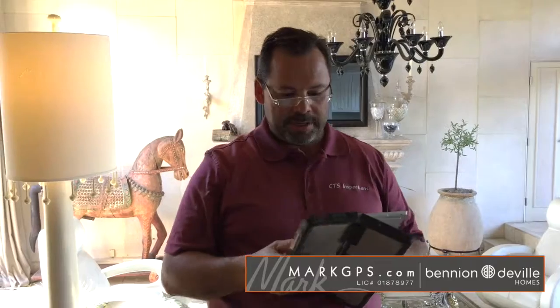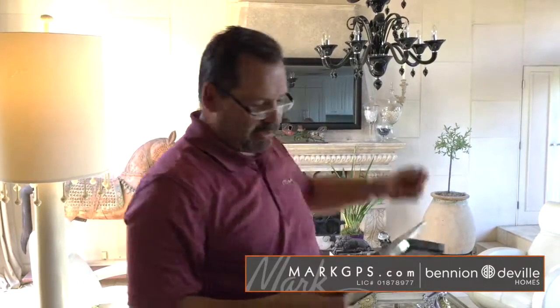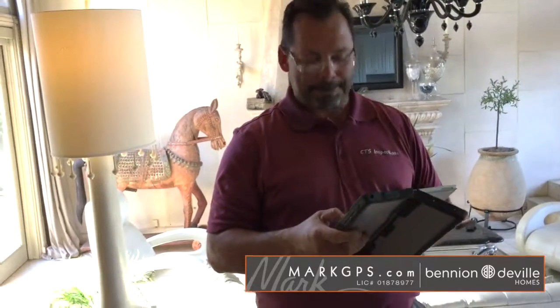Inside the main electrical panel that's located on the north side of the house, there was another circuit that was added where they penetrated the bottom of the metal panel with the wire. They did not put a little plastic bushing around that wire, so that wire is in contact with the metal panel. It just needs a plastic bushing to keep that from touching. Okay, so it's a relatively small fix.